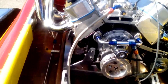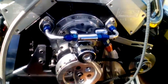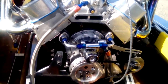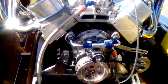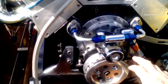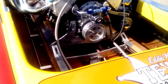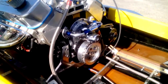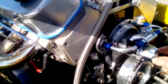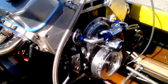Here's some information about the care and feeding of this 540 cubic inch big block Chevy. This water pump has got a rubber impeller that turns in that housing and it flexes inside the housing, so like it says on the label, don't run it dry over 30 seconds. I prefer not to run them dry at all. If you want to start it up at home and not run water through it, you can take these two screws out and pop the cover off, and then you can run it dry within reason.